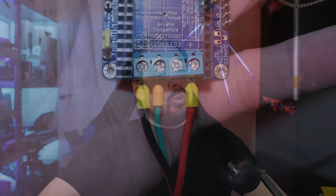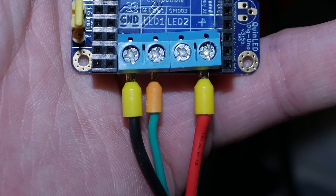I chose a spot for the controller and cut off the extra end of cables. I put wire ferrules on the ends to make sure I always have a good connection, especially in screw terminals. You kind of want to use wire ferrules to finish off your cables, making sure you have a secure connection.